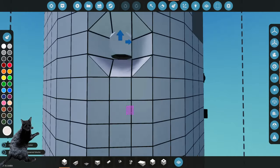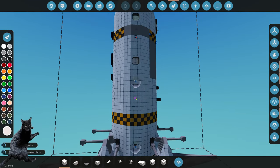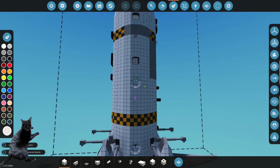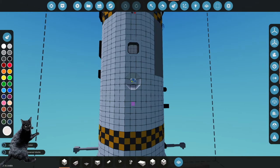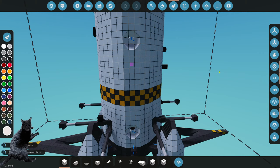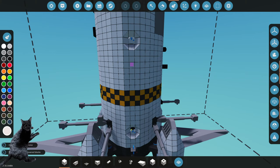And if this is the center of gravity right here, it will actually go lower as we fill the tanks, and as the tanks empty, it's going to go higher. But as you can see, this RCS thruster is going to have less of an effect than this one, because this one has that nice long lever arm. It's like airplanes with a very long tail: they can have smaller elevators and rudders because that long arm gives you more torque. So this one here is going to have less effect than these.